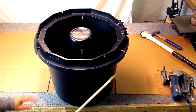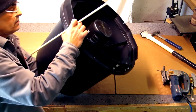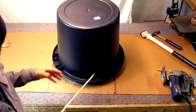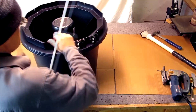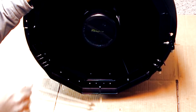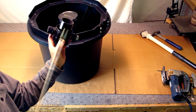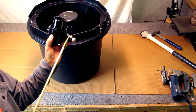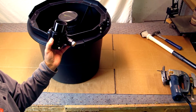Now that we've got it nicely seated by cutting the notches wide enough to let it go down, the next thing you want to do is scallop out — I'll turn this right side up — you want to scallop out this part here to allow the focuser plate, which is right here, to come through so you can get it seated. The reason is that the next thing you're going to do is mark the hole where the focuser is. We're going to mark the hole and then create a notch so that this can slide over the focuser. I believe this ought to come right to about there, three-eighths of an inch over this, so this will be on the outside of the dew shield.